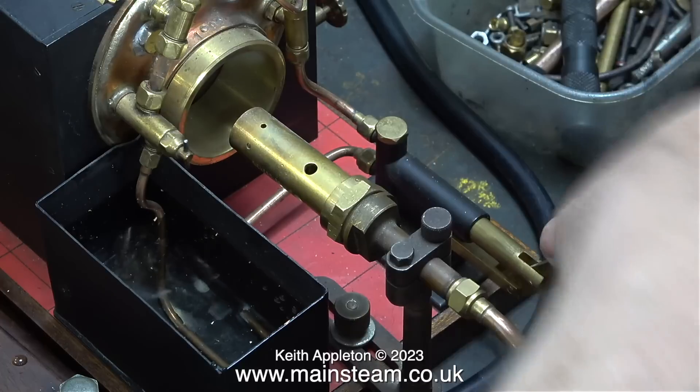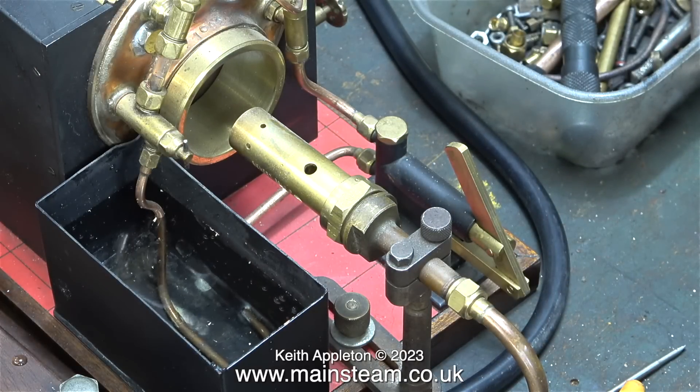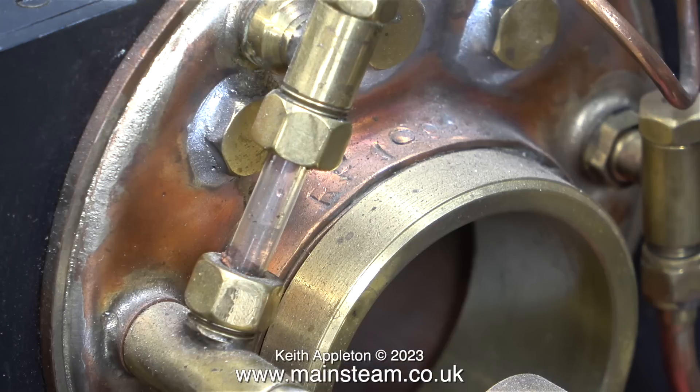What I'm showing here is a very common problem: the ball on the inlet in the valve chest has stuck. I need to unstick it. How do I do that? I just wait a bit. I've filled the tank with water and this will eventually find its way to the ball on the seating and loosen it. Sometimes though you do have to tap the valve chamber with a small hammer — I should really insert a 'top tip' logo at this point, but that's too hard to say!